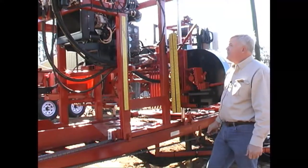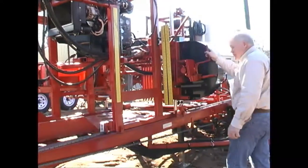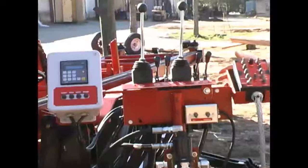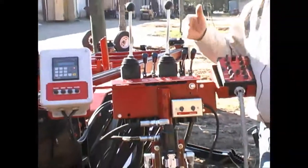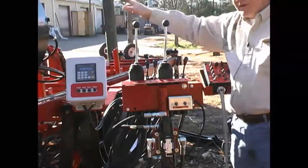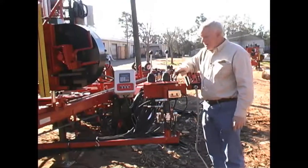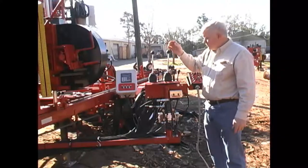From this point I'm going to pan over and you can see our control - it's on a swing arm. It can be folded up to travel and can swing out to the position you like. I start from the right-hand side because my log loader is on the right-hand side. We can mount the log loader on the other side also if a person wants, with some alterations. I lift the log up, put the log loader down, the squaring arms come up, the squaring arms go down - those are real simple, you can learn that real quick.